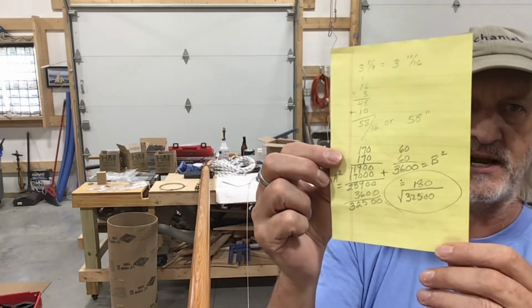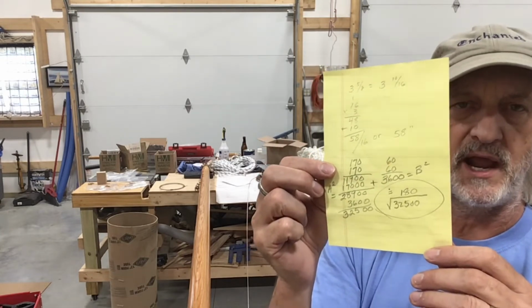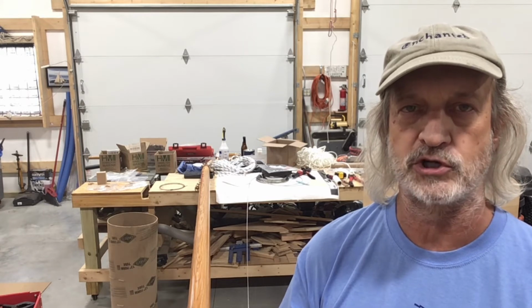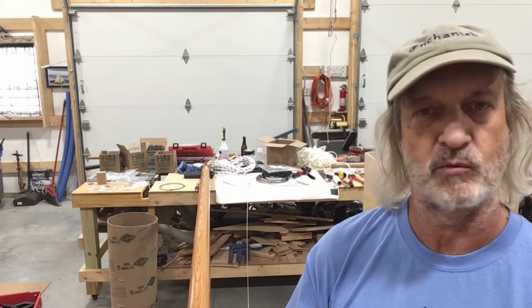So that's what I'm going to do, I'm going to cut this cable at 181 inches. And that's the longest one, because that's going to the 5 feet length to the front of the boat, to the bow. The side shrouds are not that wide, so I know that distance won't be quite as long, but just for the ease of doing it, I'm going to go ahead and cut them off at 181, and I expect to have leftover, because I haven't taken into account the length of the turnbuckles or those terminal fork jaws. So we're going to have plenty of room for error.